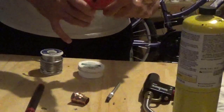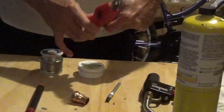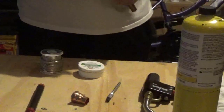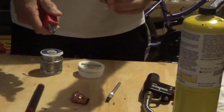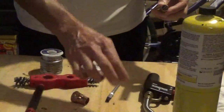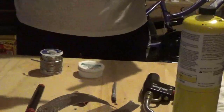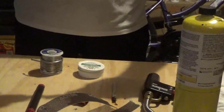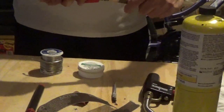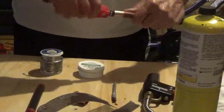Here I'm using this tool to clean the outside of the copper pipe. You can use it for half inch and three quarter inch. It has brushes at the end to clean the inside — so here I'm cleaning the inside. There I've got the mesh; you can use sandpaper if you want, as long as you keep the fitting and the pipe clean inside and out.